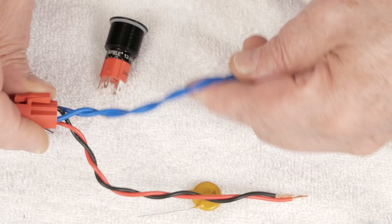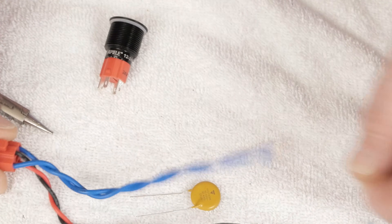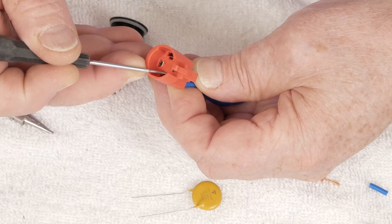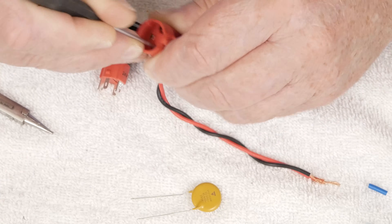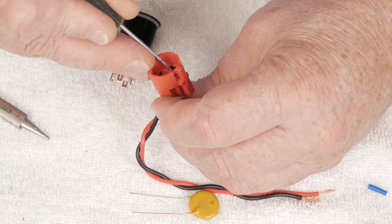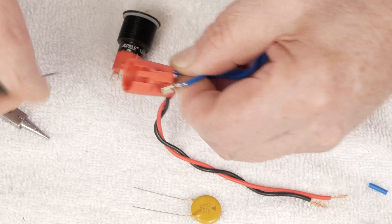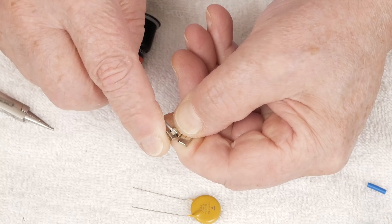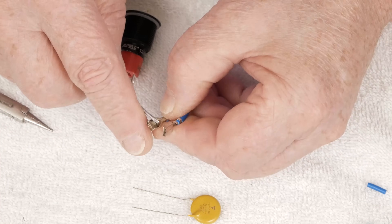You can put these anywhere in the switch — you could put them back where the wires are spliced together if that's easier. But what I've been doing is putting them in this connector. So you get a little screwdriver, come in here, and see that little hole right there? You stick the screwdriver in there and you'll feel it kind of pop up — and that just pulls right out. Then do the same thing on the other side: stick the screwdriver in, bend that little tab up a little bit, and that pulls right out. Then you come back in and bend that little tab up so that it will engage when you push it back through the hole. Do that on both of them.